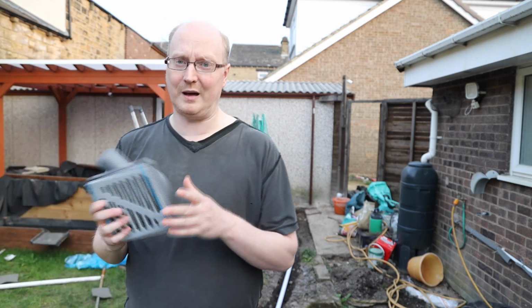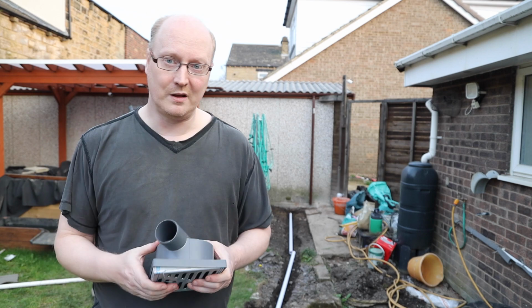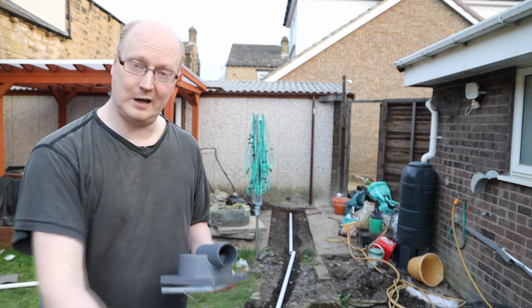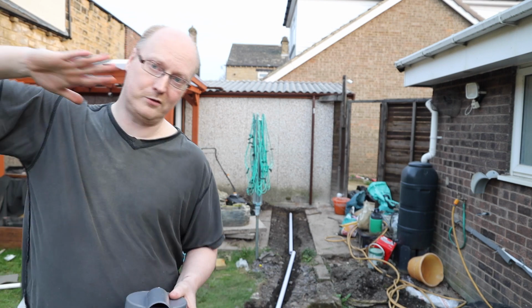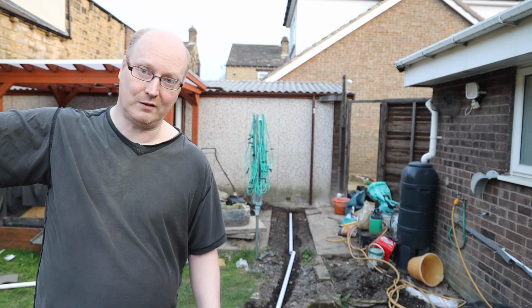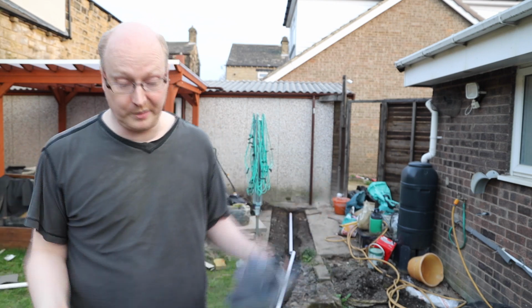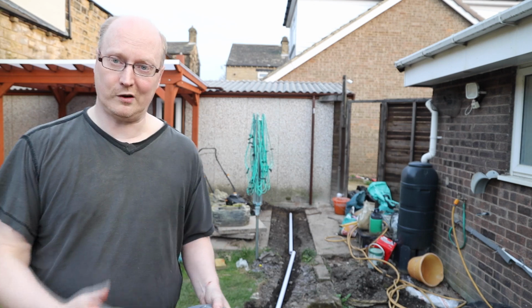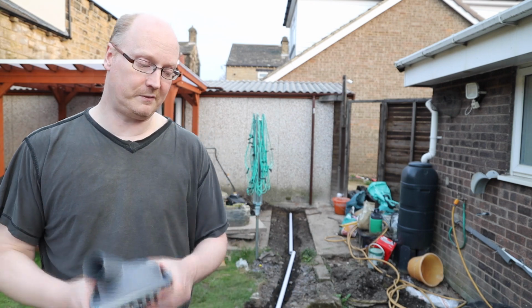So I just want to explain a little bit about drainage. Your main methods of getting rid of water are using hydrostatic pressure, where you send water from the bottom of your pond to a drain, or out of the pond down a hill using just a simple pipe, and the pressure of your pond will do that automatically. Another way is you dig a deep hole, put a sump pump in there and pull it out using power. And another method would be to build a proper drain underneath your pond and connect it to a drainage system, like a grey water drain, or if you've got special permission from the water board, you can send that to a sewer system, but they normally charge you extra for that.